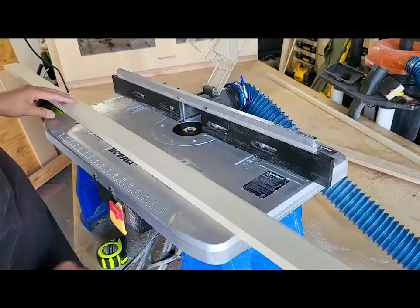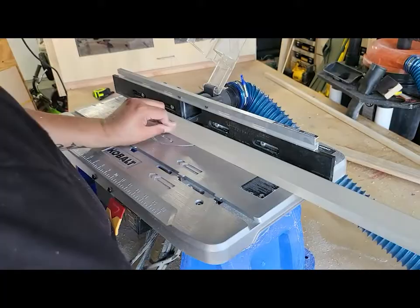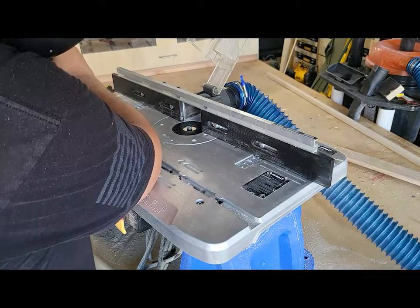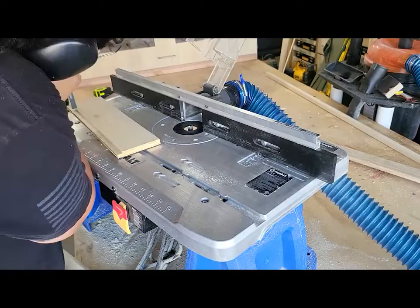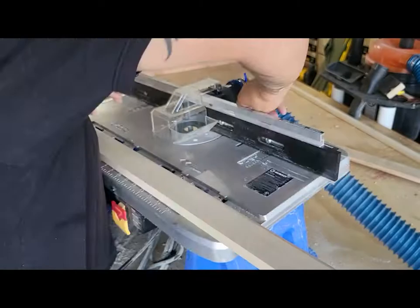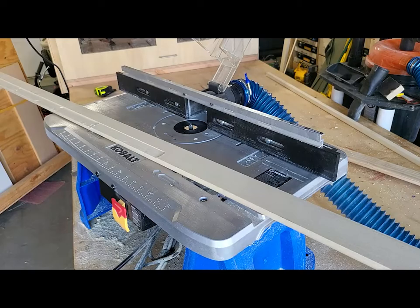On the other piece I had to do exactly the opposite — starting with the deepest cut at the bottom and adjusting shallower and shallower as I moved up toward the middle, otherwise I would have been routing in the wrong direction. Due to the width I needed to cut and the relative size of my bit, I had to keep adjusting the fence back and forth to do it in two passes. It was tedious but once I got into the groove it went smoothly and it ended up working out really well — even better than I had anticipated.